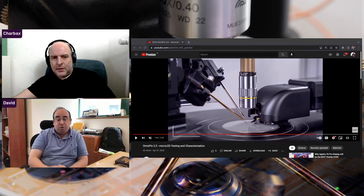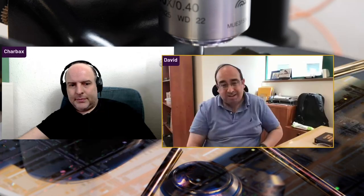One thing to highlight about televisions: power consumption on a TV is not a big issue, but one of the promises of micro LED is that as chips become smaller they'll still be very bright. A core measurement is EQE — external quantum efficiency — how much current you put in and how much light comes out. You want that very high and consistent. The promise is EQE around 80 percent; today it's still around 20 or 30 percent in a lot of devices.